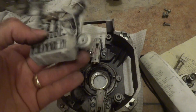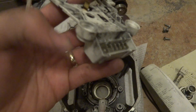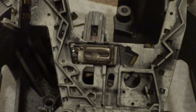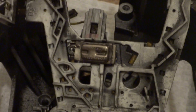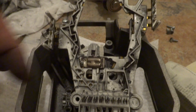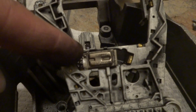This is the socket that you connect your plug for the motor — I took it out from here. And that is the overload protection here. I will put up the model number of the overload protection. I tested it and it works fine. You can connect a multimeter with a continuity test across these two terminals.